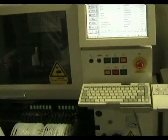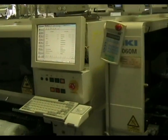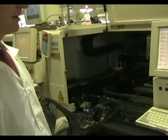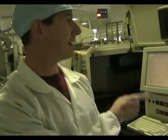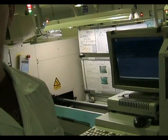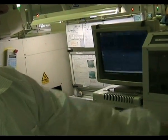And then just in case your board's got too many components, it'll go into the third pick and place machine, and then it'll pop out. Then there's a manual visual inspection, and then it goes into the reflow soldering oven.